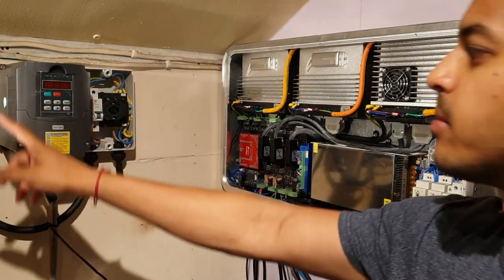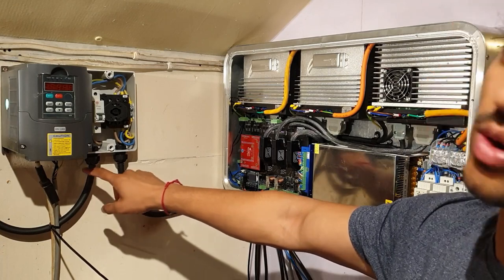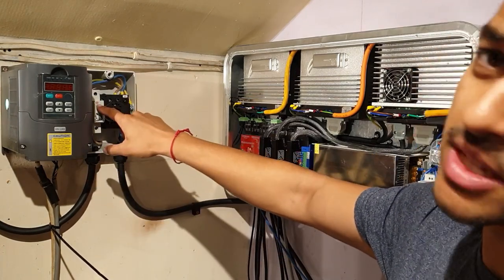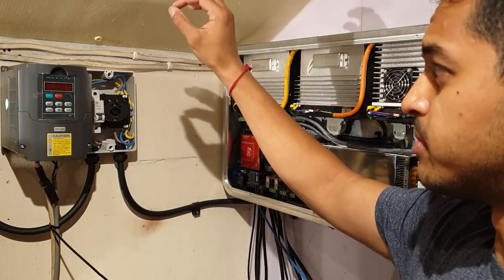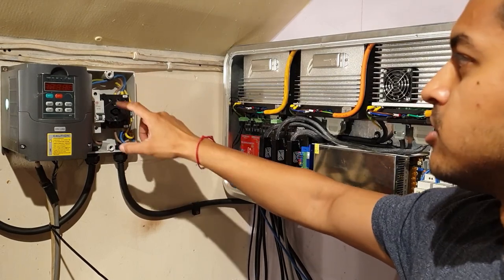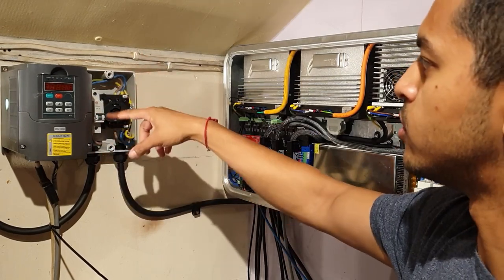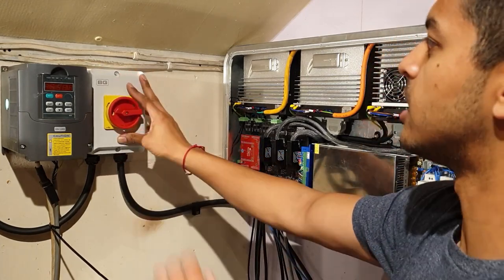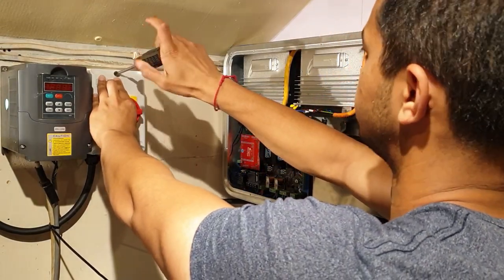So I've got my input power coming through here. We're on a 3-core, so that's a neutral, live and ground 6mm square cable. That's running through an MCB, so that's a 40 amp MCB. I've worked out the peak current going through this should be 36 amps. So a 40 amp MCB is over here, and that runs in through this isolator switch. So the isolator switch is just wired in as such, and then the idea is, just screw that in.